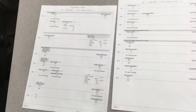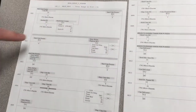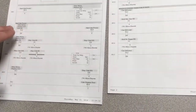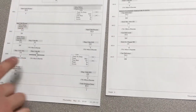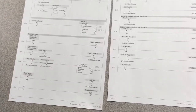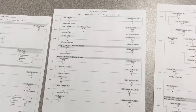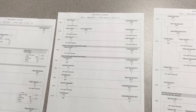So this is our PLC code. For each process, I use the push button to latch a bit, which then triggered that timer that I was talking about earlier. Then after that, the done bit unlatches that bit, and then it triggers another timer for that back cylinder I was talking about. And then I have bits for the front one and the rear one to say, okay, this cylinder is done, so now the photo eye can move to make sure the pop can is in the trough, so it's not delivering nothing.